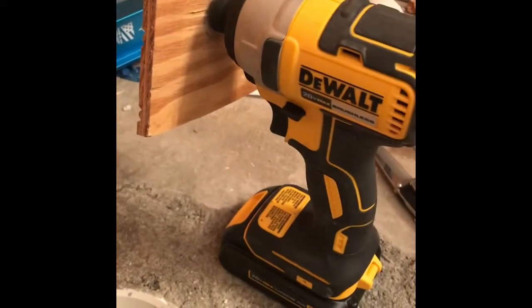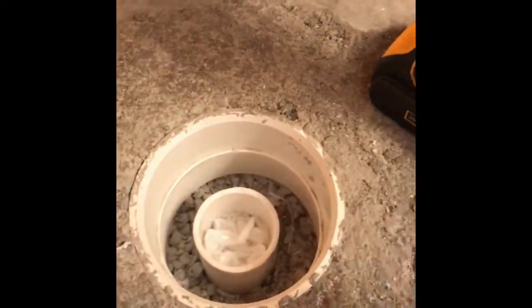What I'm doing is taking my deburring tool — a burr is kind of a sharp edge spot — and taking this plumbing deburring tool around the top edge on both the inside and the outside. I'm putting it at a bit of an angle, basically trying to take off another small amount of that PVC pipe on the top to bring it down just a little bit further, so the spacers with the drain in there will sit right on the floor instead of just a bit high.